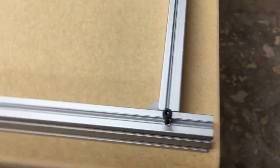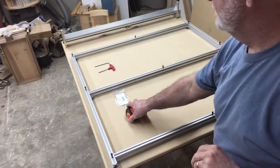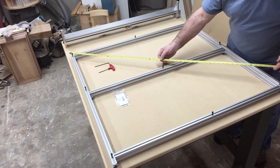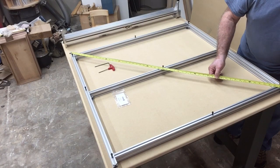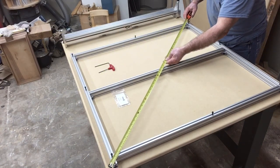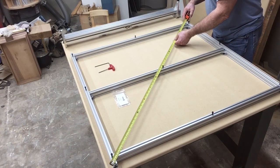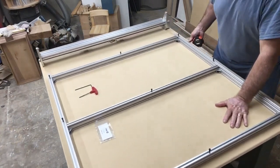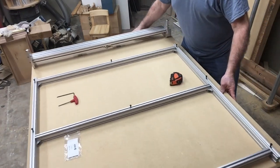The next step is to make sure that the frame is actually square. To check for squareness of this base frame, it's imperative that you realize that a framing square is not necessary — you want to use a tape measure and measure from corner to corner, and you want that measurement to be exactly the same. When I measure corner to corner in both directions, my measurements are within less than half a millimeter difference between the two measurements. That is good and acceptable — I'm not going to try to make an adjustment for something that's less than half a millimeter. So this completes the base frame — everything is tight, secure, and it is square.